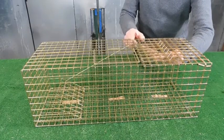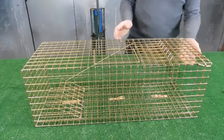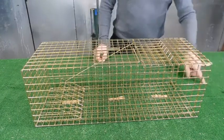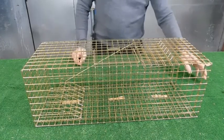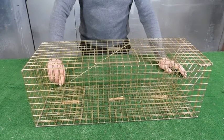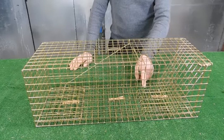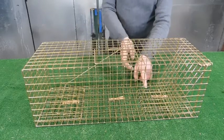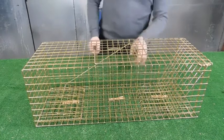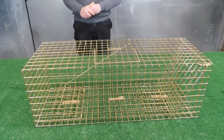Bring forward the setting bar and let go of the door — trap is now set. Rabbits pick up the bait, walk into the trap, and stand on the tread plate. The door drops and the rake stops it coming out. When the rabbit tries to go, it stands on the tread and the rake stops the door opening. That's the standard and heavy-duty rabbit trap.